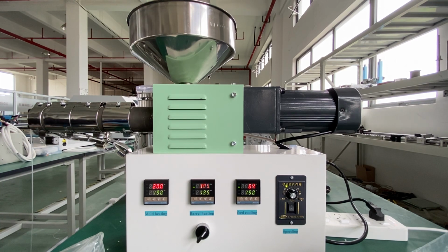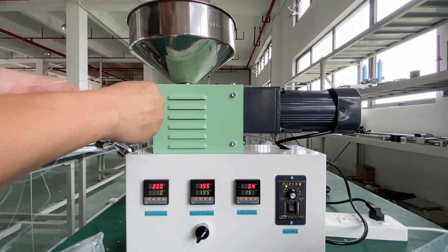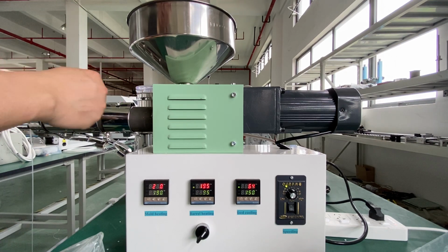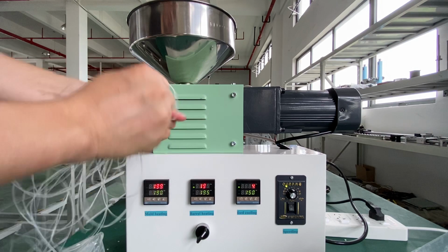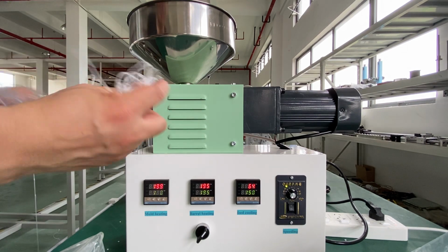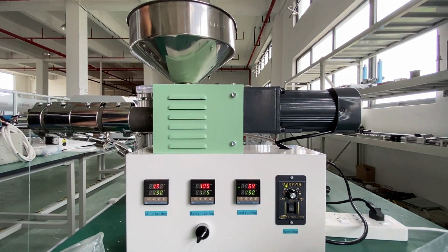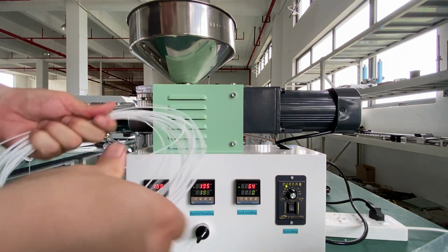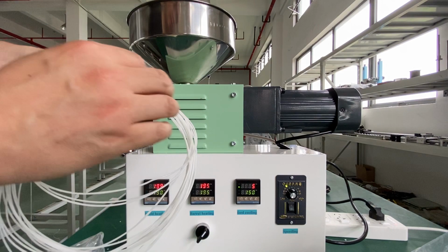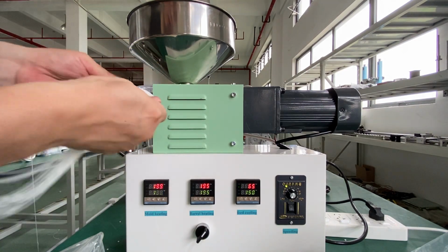And the PETG, you hear the screw has some noise with the barrel, so you just do like this, you can hear the noise. But this POM, no, it does not sound like that. I think the POM is some kind of self lubrication, okay? So that's why we use it as the nut, okay?